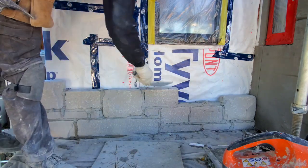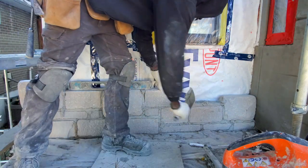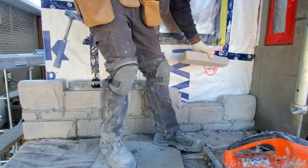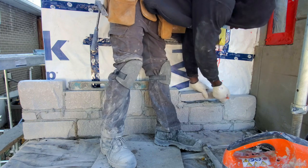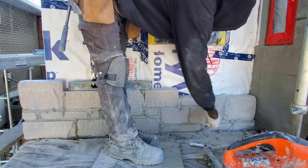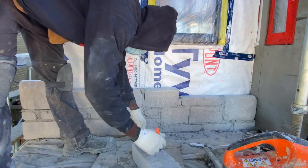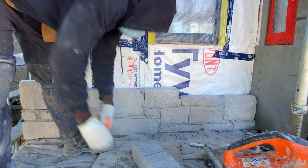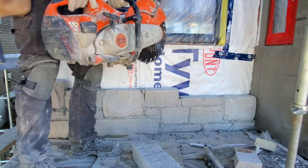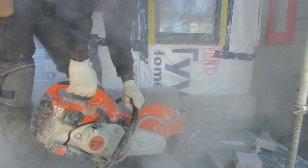So you see, I put this medium stone right beside this jumbo stone here. Automatically, you would have to put that medium stone there because you don't want to go any higher than that jumbo stone that sits right on top of my level here. A medium and a small have to add up to the same as the jumbo stone. So once you reach the height of a medium and a small, you have to put one right across to break it. And if you continue to follow that rule, automatically the stone will form its own pattern. Keep on watching, you learn as we go.